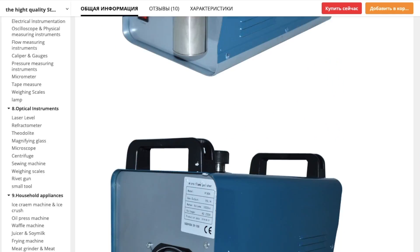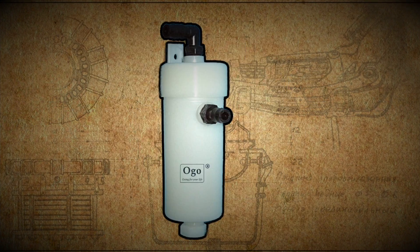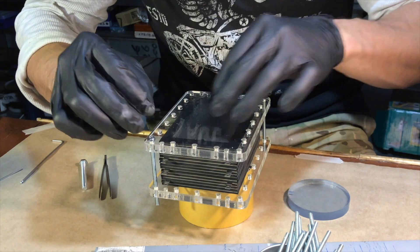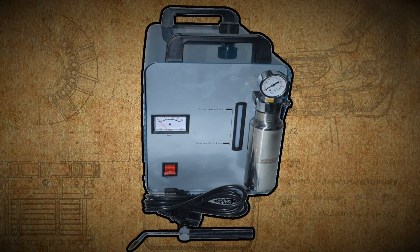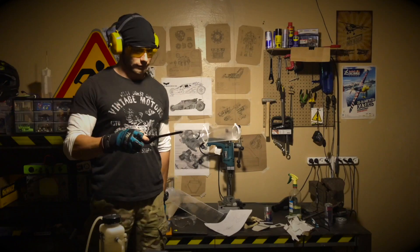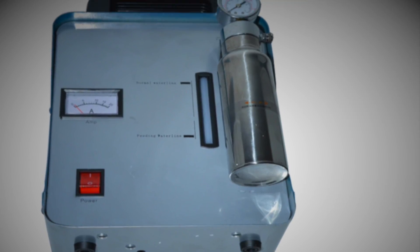And the top of our rating today is for guys who love to get everything ready. All previous items assume you need to make part of the equipment yourself. Number 10 is a complete hydrogen generator powered from the mains, with all units ready and a gas burner included — 600 watts, 1.5 liters per minute, a complete tool for welding, soldering and other hydrogen fun. The only disappointment for the experimenter: this unit is like Windows — you can't change or upgrade anything.